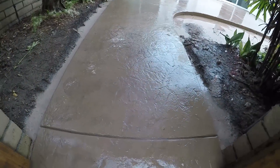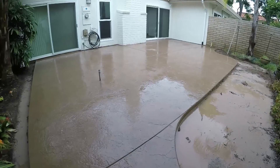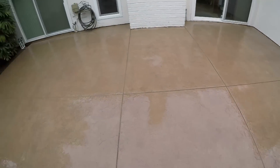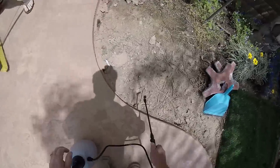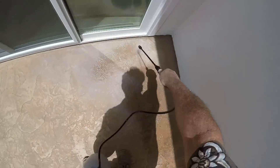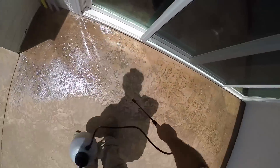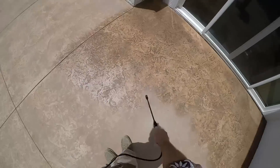Here's what it looks like — there's not a lot of contrast at this point because the concrete is still dark. As the base lightens you'll see more and more contrast. I rinse this by doing it many times and taking the right amount off, and I won't know if it's even until I come back to seal it. Now coming back to seal you can see it's lightened up a lot, so you can see more of the contrast. I'm putting on a lacquer base — I like to use Diamond Seal from MatteCrete. It's thicker than a lot of others, and the thicker it is the better — that's how I judge lacquer base sealers.